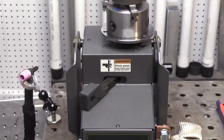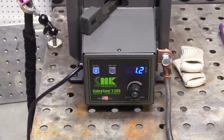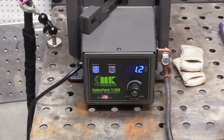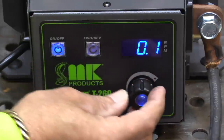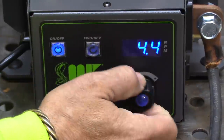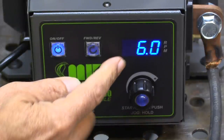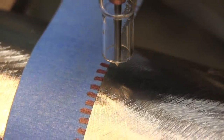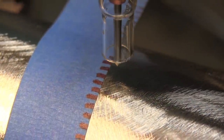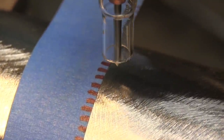Here's the one I'll be welding with today — this is the Cadillac. MK Products Cobra Turn T260, super smooth with a digital readout, which is a big deal for a turntable. This one goes all the way down to 0.1 RPM all the way up to 6 RPM. You need higher RPMs for really small diameter parts and low RPMs for larger diameter. Figuring out travel speed — I used to use a piece of tape with increments and eyeball it, which got me in the ballpark but wasn't very repeatable.